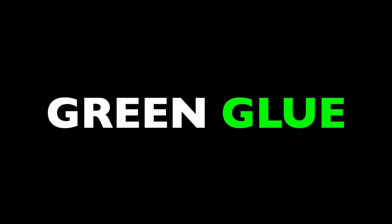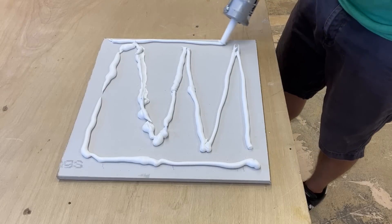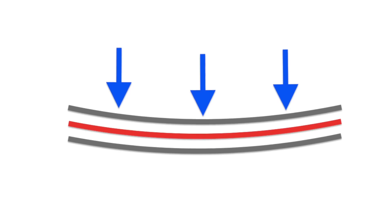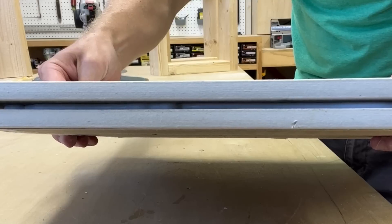A company called Green Glue is kind of the industry leader on this — they're not my sponsor, they just have a couple really great products. The first is a dampening compound. It's meant to be squeezed onto one drywall surface in a 3/8 inch bead in zigzagging stripes, and then the compound stripes are compressed between two pieces of drywall. As sound hits the one drywall surface, vibrations bend the wall ever so slightly. This creates shear forces in the compound, sort of like sideways stretching, which causes the sound vibrations to get knocked out of line or scrambled. And what happens to them? They turn into heat. It's strange to think about sound turning into heat, but that's actually what happens to a lot of expended energy — the sound waves just sort of cease to exist. They burn themselves out. So a double drywall layer with a noise-proofing compound core is really a great way to reduce low-end frequencies.